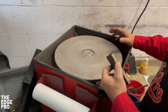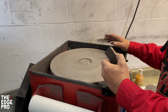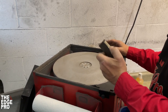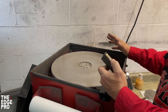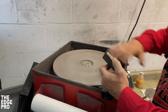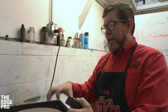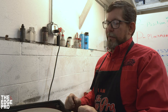You saw I was doing that swirl pattern — you could hear it. In terms of how much pressure to use with the rub block, I always say it's similar to cleaning a frying pan with a scouring pad — I want to put a little muscle into it, about three or four pounds of pressure. I'm not light or gentle, but I'm not going to damage the plane of that surface. What I do want to do is create swirl scratches, opening up the aluminum and allowing it to bond with my adhesive and grit, giving us nice coverage.